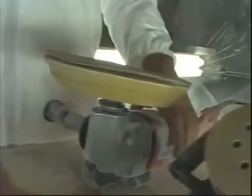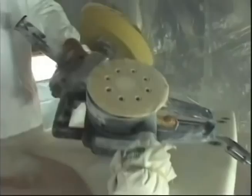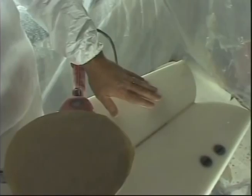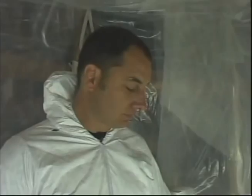The board has cured — in other words the resin has dried. We've actually done a little bit of sanding because the filmmaker was not here yesterday. The sanding involves a lot of work. We've got the big grinder with these things called soft pads that you attach to them, and then this smaller buffer. Basically you've got paper that starts at about 80 grit and then goes up to 600 or so. The last stages are with water because you don't want to go through the resin — you'll end up with foam and then you'll have to fix it, and that's a big problem. So it's slow and easy, and it's something you can only learn with practice.